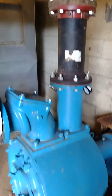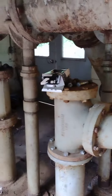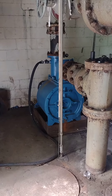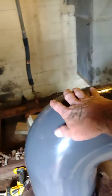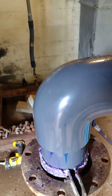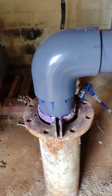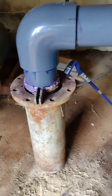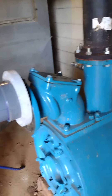This is our fourth week out here on the Allendale project. We have 40 horsepower Crown centrifugal pumps. We had an issue — this one was sucking air because the pipe was broken about four feet down. Now we have a solid piece of pipe 12 feet deep, with the drop pipe actually 12 feet to the floor of the pit, so we're hoping that takes care of the problem.